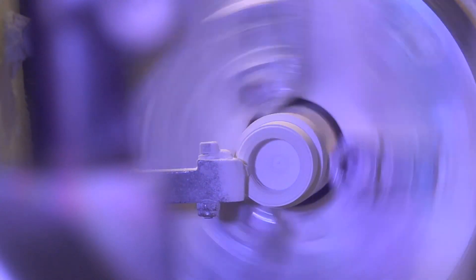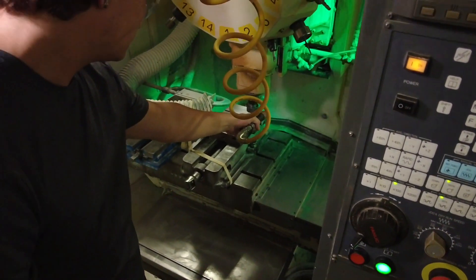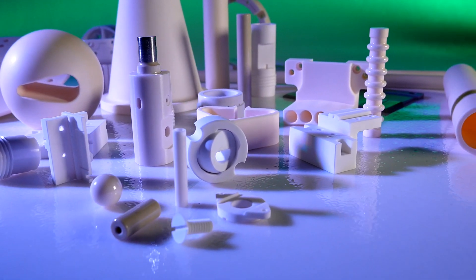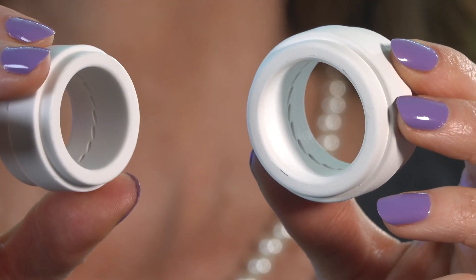When we're green machining, we can turn parts, mill parts, and surface grind parts very quickly to remove material. Traditional drills and mills used in everyday metals machining can only be used in the green state. When you're in the hard state, specialty diamond tools are required — a regular drill will just disintegrate when pressed against a fired ceramic part. We have additional complexities because there's different linear shrinkage versus radial shrinkage, which makes it even more difficult, but we're able to do it.